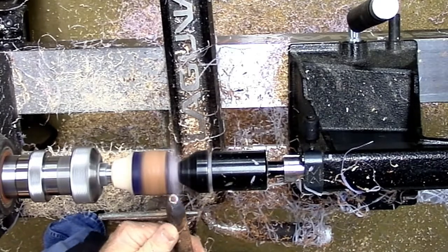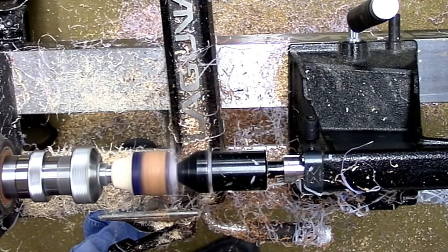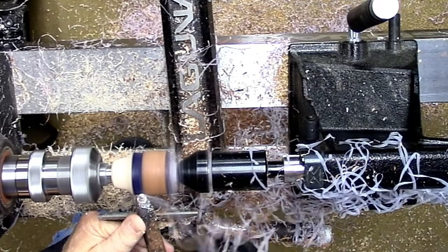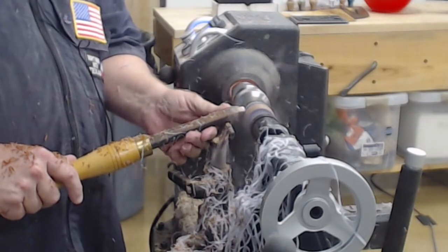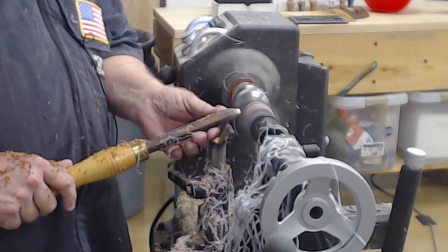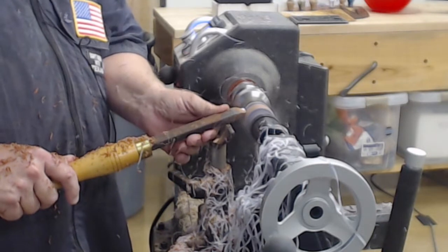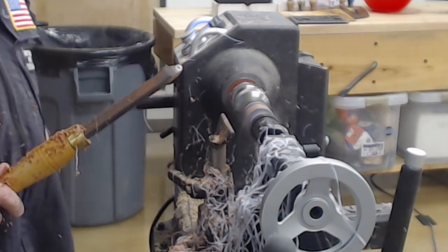My sanding, I usually have my jet vacuum going, I got an air cleaner above my lathe and a vacuum right on this side of it. And when I'm doing heavy sanding, especially on my bowls, I have that thing going. And I two-stage the vacuum with one of those trash can separators, and that makes a huge difference. In 10 years, I have not emptied the bag yet off my dust collector with that separator. Now the bag's getting a little heavy. I may need Wendell to come help me lift it and change it. And the other sad part is I don't know where the spare bags are at this point after 10 years.